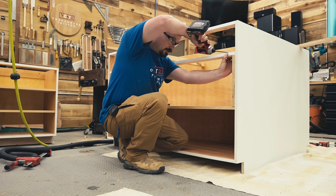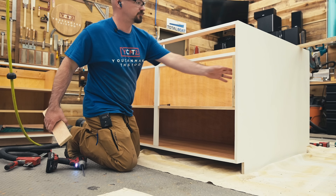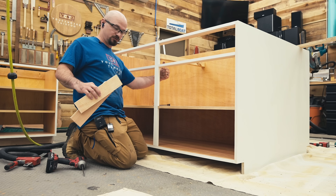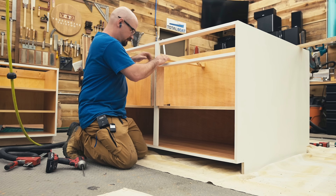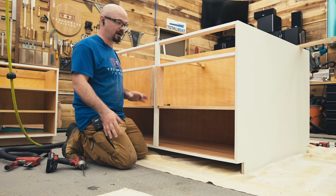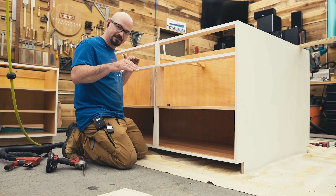Using identical blocks at both ends, I can know that this is very true and parallel. I'll also run a screw through the back into the front rail, using my blocks to make sure we're staying consistent even if something isn't perfectly flat. Whenever I do drawer slide installs, shelves, all kinds of things, I'm always keeping my offcuts and using them as stop blocks to hold everything square and consistent as I move along.